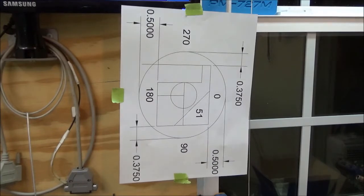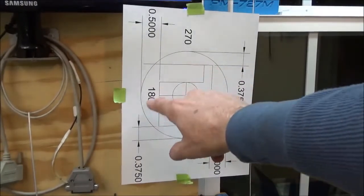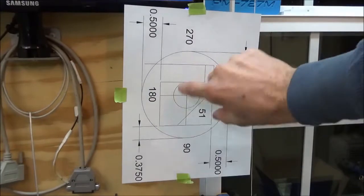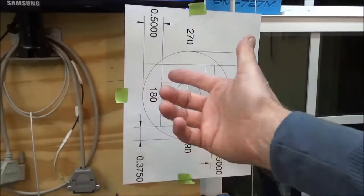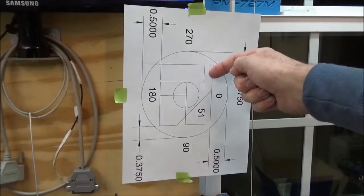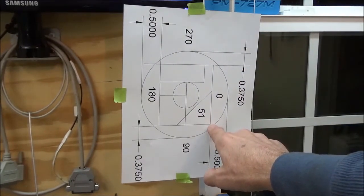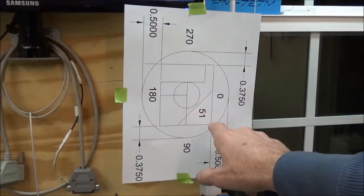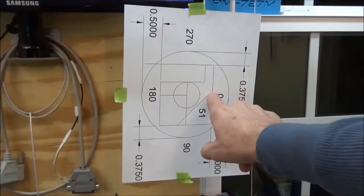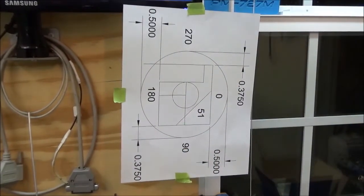and all I have to do is just come back to it and start from where I'm at. So I just figured I'd share the reference sheet that I had made to keep up with the angles and what I was doing on them. These are the different heights. These two surfaces have a different height than this surface and this surface, so that's the reason why I milled this off. And then when I come back, I can reference the flat places, and on this side I'll just machine it off. I'll take a measurement from this corner to this flat spot, and then machine that off flat. Then I'll be able to reference this corner right here for my work offset to put the letters in the center. It would be plenty accurate to do that.